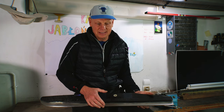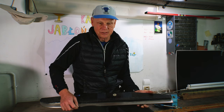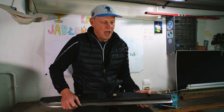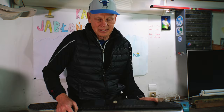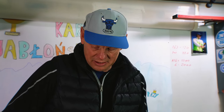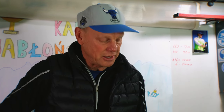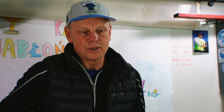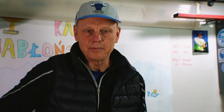You have to be aware, and we all know, that we use those runners in different ice conditions and temperature conditions. And we all know that once you put the runner on the sharpening machine, the steel is getting hotter, and the runner is actually becoming more crown. So it's very important to cool down the runner properly after you have done some work on it.